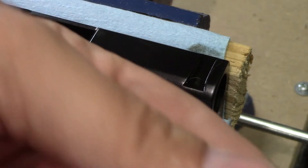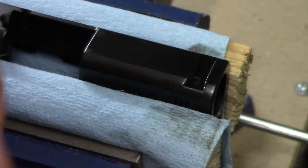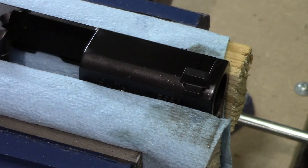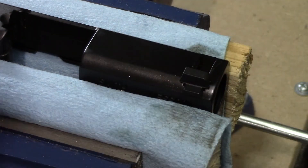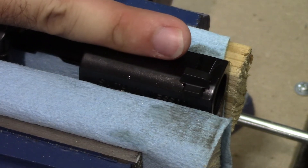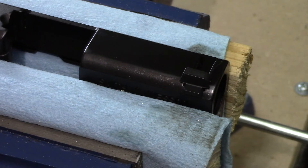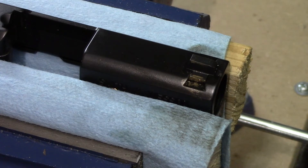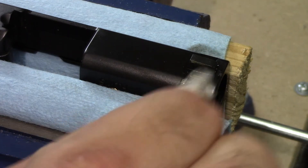For the front post, here it is right here. Go ahead and test it out — should fit just fine. Get your brass punch and we're aiming for the center again. This one was a little different — I didn't put a pencil mark on it, mostly because as you slide it it kind of rubs away. So what I'm going to do with this one is estimate where it is and then take a tape measure to measure exactly where it is. A better option is a caliper, but I don't have one of those. I think we're there — go ahead, take a Q-tip and clean up some of the brass. Next time you clean it you can get this cleaned up a little more, but looks like it's perfect center, and the rear is perfect center as well.